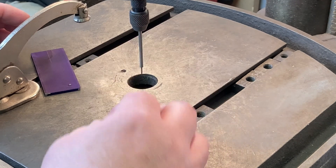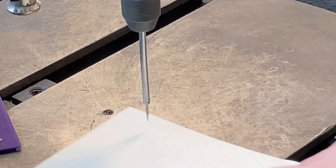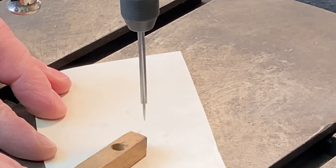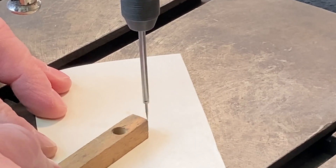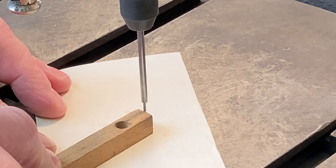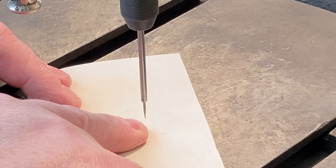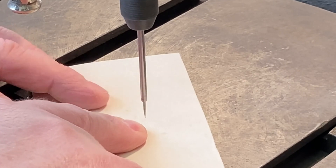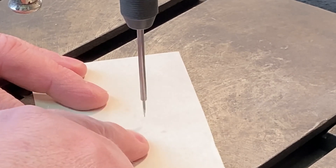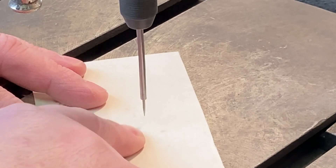The next thing you do is turn on your spindle — you'll see that it runs eccentric. I'm going to put a piece of white card material underneath the spindle so we get better contrast so you can see what's going on. I've got a small piece of wood here — actually a small wire brush handle — and I'm going to run this in toward the needle until it makes contact and it will run true. As you can see, it has now straightened itself out and is virtually motionless at the tip. This is exactly what we want. We now know the spindle is precisely centered under the point where this needle is. As long as we don't bump or move it, that point will point directly to the spot where we want to drill. We'll turn the spindle off.